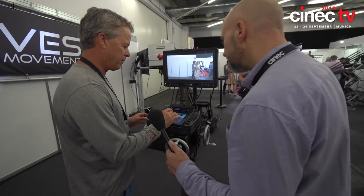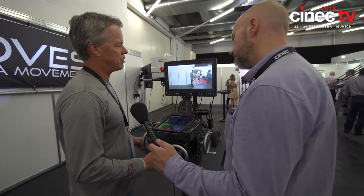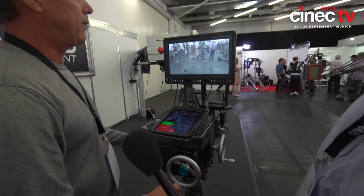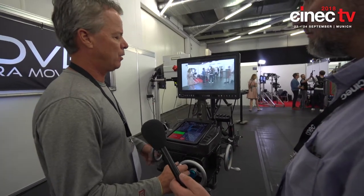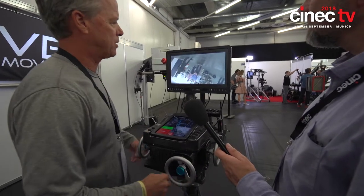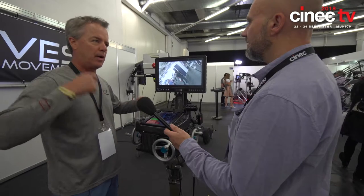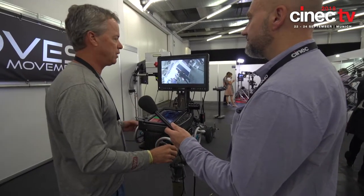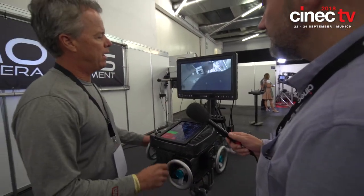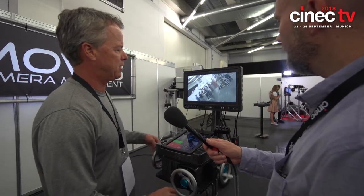Probably the most significant feature of the interface is that we've got two modes. Earth relative mode is how a traditional head would operate — this is my pan wheel, this is my tilt wheel. Now, if I start to introduce a roll and get that going, there's going to be a point where my controls cross: my pan becomes my tilt, my tilt becomes my pan. There are some really good operators out there who can make that transition in their mind, but it takes a really good operator to do that. What we've come up with is called image relative mode.